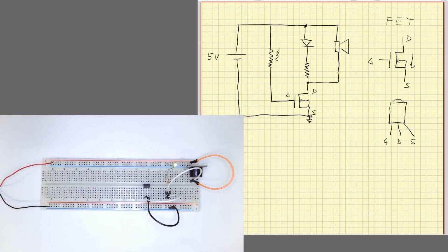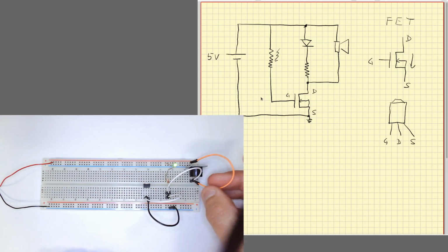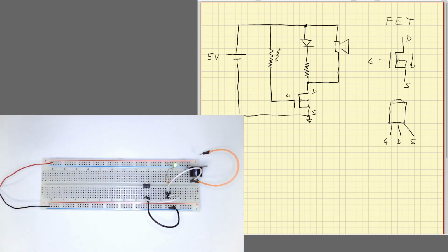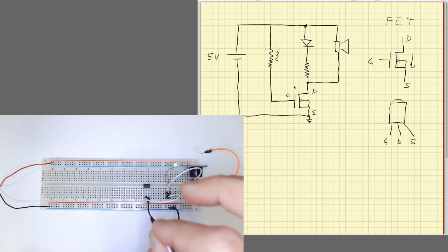It's still running. So the problem here is that our transistor is very sensible, and also the gate is not physically connected. So once I elevate the voltage here, it gets at a high level. Okay, even if I disconnect the photoresistor, the voltage is kept at a high level. To show you, I will do it with just a cable.